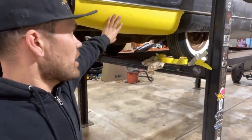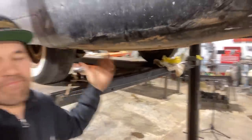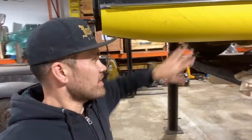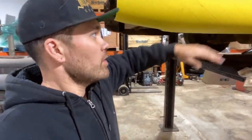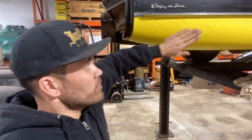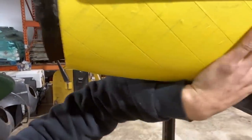I ended up cleaning up and templating the passenger side because it was just in a lot better shape — it's kind of flimsy on the driver side, and we get more information off of the better side. The beauty about doing a pattern like this is you can flip it inside out. I didn't have any fiberglass reinforced tape for the center to really hold its shape, but it still works with multiple layers of masking tape. The number one thing to remember is to overlap the tape halfway — don't go more than halfway so you're not creating any extra thick strips.